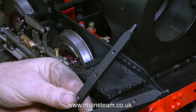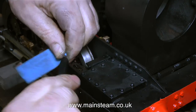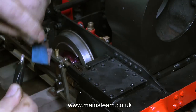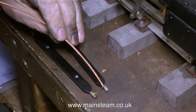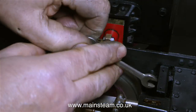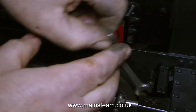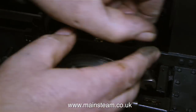Once we've fitted these brake arms that go between the spring hangers and are connected together, I'm going to lock up the entire mechanism so it can't move. So that the ends of these parts fit into the spring hangers — I've cleaned them up using a piece of emery cloth and I'm using some oil because I don't want them to rust solid. If they're not going to move they could just go rusty, but with some oil on there there's less chance of that happening.